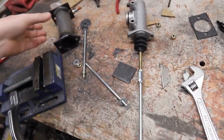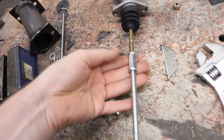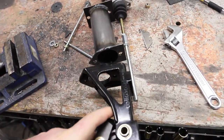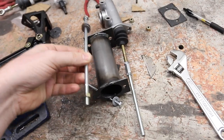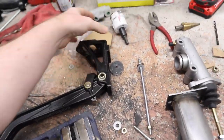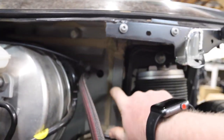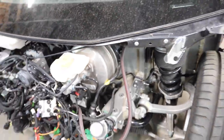Fabrication is done, and I made a trip down to the hardware store. Here is our extension piece — it goes ahead and slides on like that. We've extended our threaded rod and we have a little bit of adjustment as it slides in. It kind of goes from that piece to that piece to this piece. There's really no point test-setting it up because it needs to get installed in the car. Basically these bolts run all the way through all three pieces to hold it down tight. Next thing we've got to do is find our placement in the car, drill a hole that looks exactly like this — Oscar's already got the template for it — and it's going to land right around here in the firewall. We got very lucky that it doesn't need to land anywhere there's no room. This is going to be one where we test fit about 15 times, drill one hole, and pray that it's perfect.